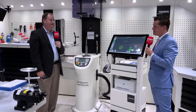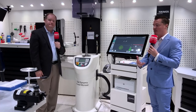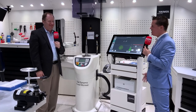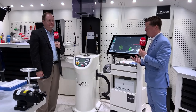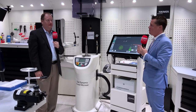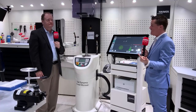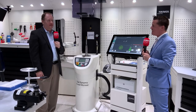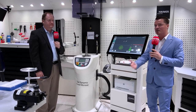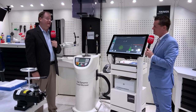If I may expand on some personal experience — some people know I came partially from a background of air turbine spindles, and those high-speed accessories can go in excess of 90,000 RPM. Balancing was extremely important, and if that balancing was not done correctly the runout would be bad, tool life would be reduced, but also it heats up, which adds to expansion and breaks down the bearings quicker than they want to be. You compound that on a CNC spindle — it's just bigger and stronger so it'll last longer, but the same concept is happening. Absolutely, you nailed it on the head Tony.